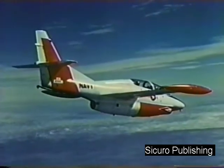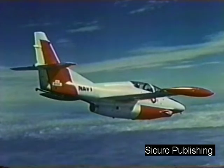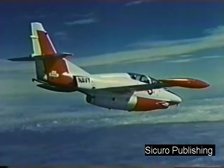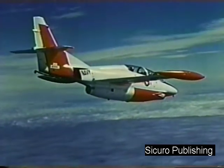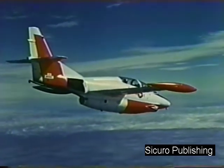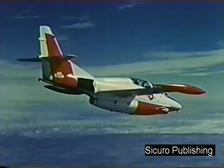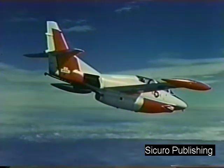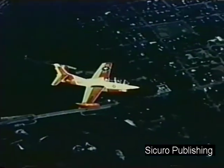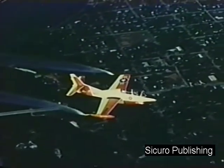Now the letdown and landing. During the letdown, speed brakes are used. They may be extended at any airspeed and can be stopped at any point in their travel. However, when the speed brakes are fully extended, a slight nose-up pitch is experienced. If you plan to leave the speed brakes extended, some change in longitudinal trim will be required. Before entering the pattern, dump the fuel remaining in the tip tanks.